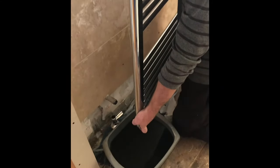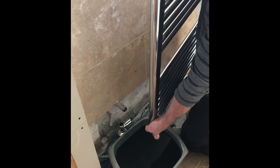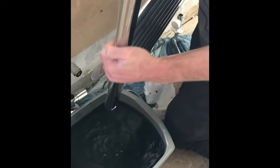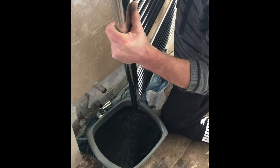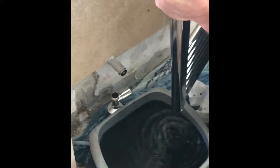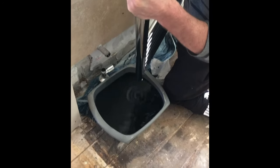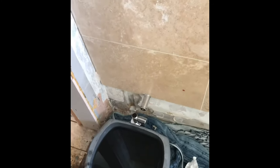Okay, so you've got your radiator off from both sides. Tilt it slowly with your fingers on the holes and just allow the last little bit of water to come out. If you need a second person for this then get them. You can see how dirty that water is. And that's all set - we can then take off the fixings. Radiator all off.